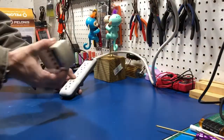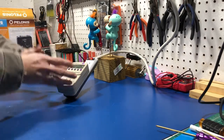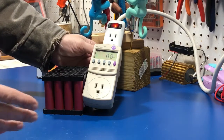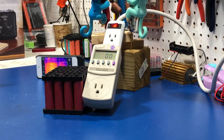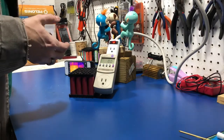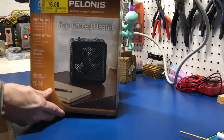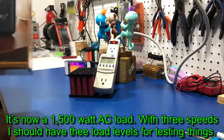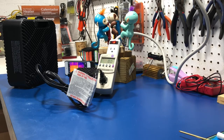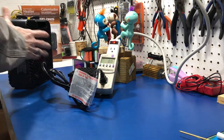We need to put a big enough load on here to test it and measure it. The cheap easy way is a watt meter, and we're going to use the FLIR camera. To draw around where I expect the microwave to be drawing, I picked up this 1500-watt electric heater — found it for five dollars. It has low, medium, and high settings, so I expect to pull about three different power levels out of it. We'll set the thermostat to max and blow the heat away so it doesn't affect the thermal readings.